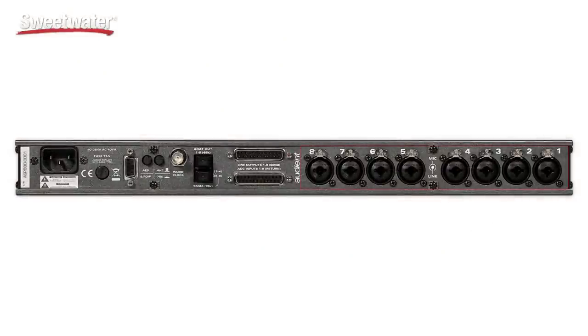The back panel is very straightforward. There are eight XLR inputs for the preamp, then one D-sub connector that feeds eight analog outputs and one D-sub connector that accepts eight analog inputs to feed into the analog-to-digital converter. Next to that are ADAT outputs supporting up to 96 kilohertz using the S/MUX format. There's also a BNC connector for word clock signals with switches for setting impedance and termination. Then there's a 9-pin D-sub connector carrying eight channels of AES-EBU digital format, or you can switch that over to stereo S/PDIF.